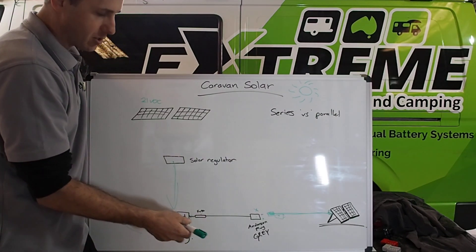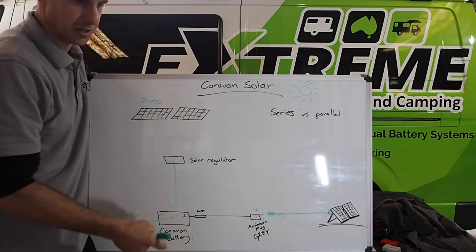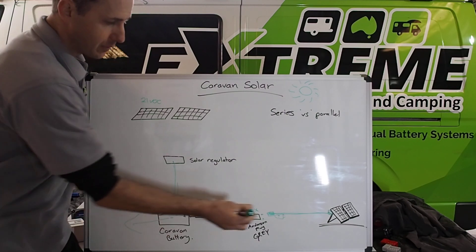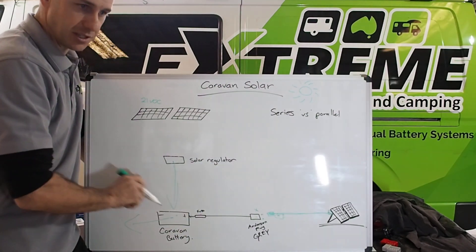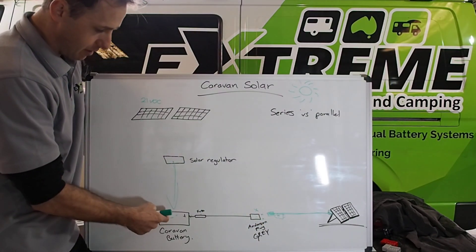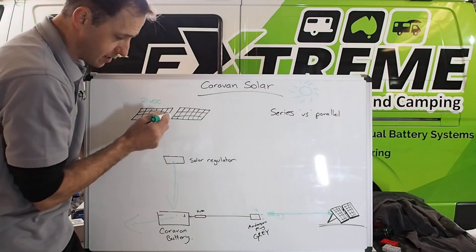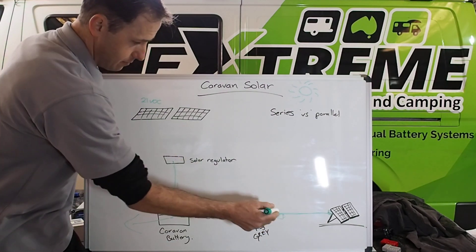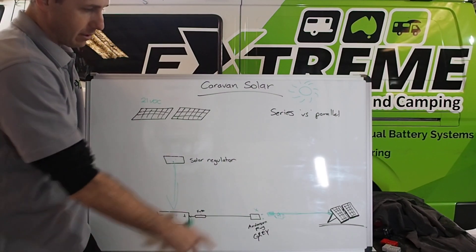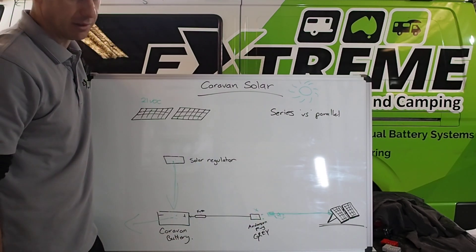It's not just about whichever biggest charge is going in — it's mainly the voltage of the battery. If the voltage is at 12.1V and you've got a mains charger pumping in 30 amps and the voltage is slowly coming up to 12.2, 12.3, the fold-out panel will continue to contribute as well. Then as the voltage hits 14.4V, the fold-out will see that and back off, or it'll help if the battery is really low and sucking up those amps. Having two separate charge controllers is completely fine — each will monitor the battery and charge appropriately.